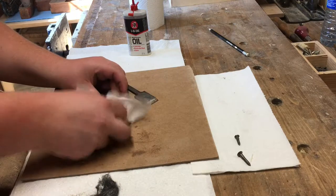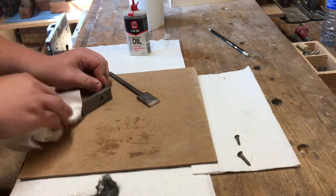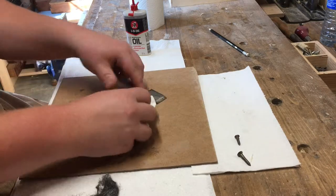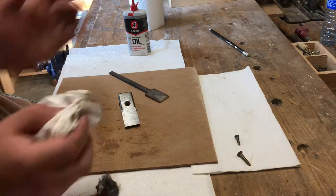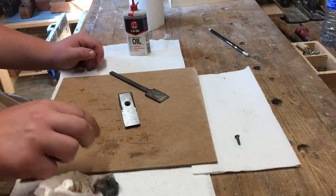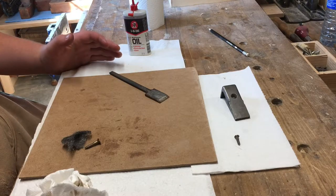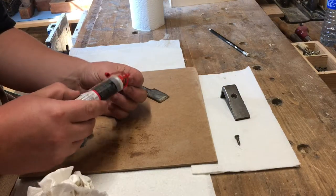There's still some residue coming off it. I find the vinegar keeps the patina but gets rid of the rust — I really like a vinegar treatment, because it just removes the rust if you time it just right. Don't leave it for too long; if you leave it for too long, it can wreck things. I always aim for under the suggested amount of time, and then you'll never go wrong. You can always just put it back in for a couple hours and see how it went. It's like when you cut wood — you always cut it long, because you can still cut it down but you can never add it back on. I apply the same theory with vinegar.